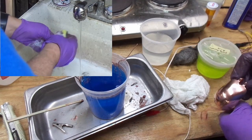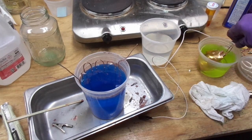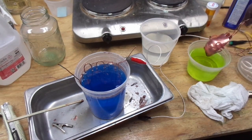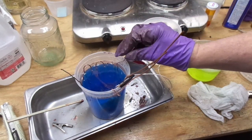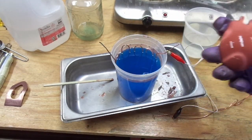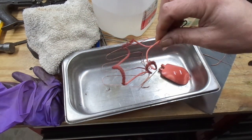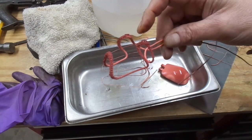I've washed it in the sink with soapy water, put it back in the cradle, and I'm going to put it in the hydrochloric acid — the muriatic acid — for just a handful of seconds. Positive lead goes on the anode. Give it a rinse in distilled water, and I put it in — the spoon side is facing the anode. It's been about 10 minutes. You can see the marks on it; my best guess is the cradle scavenges the plate, so I don't quite get as even a plate as I'd like. Here you can see the cradle after a gazillion plating attempts — plating doesn't necessarily go smooth.